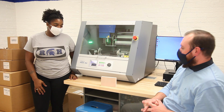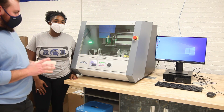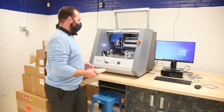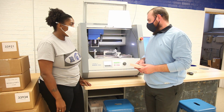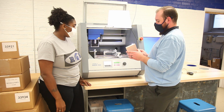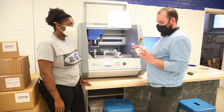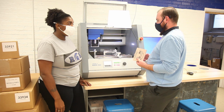Yep, so to get started, we're going to be measuring our piece, and then positioning it in the mill before we go to software. To position your piece in the mill, you're going to position it between these two devices. We're going to use this block mostly because it already resembles the thickness of a yo-yo. That's very important when deciding what piece of stock to use in regards to what we want to make.